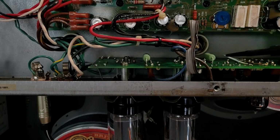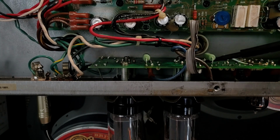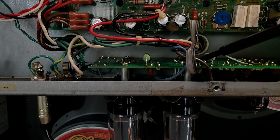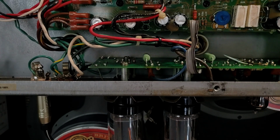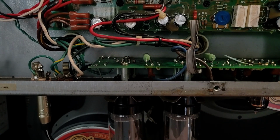So I put in new 5-watt 1K screen grids mounted on top away from the more direct heat of the tube with some airflow so they will run cooler. And I verified all the connections, and I reflowed the critical 3, 4, 5 pin connections on the output tubes. And that took care of the sound coming in and out of standby. And that made the tubes no longer make awful noises if I rattled them.